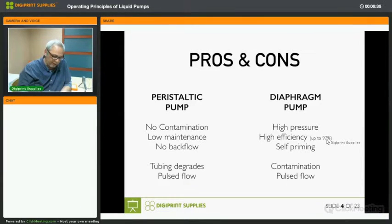You need to have a chamber that collects the ink and feeds the print head in a slow, smooth, continuous way. That's where your damper comes in, or the combination of a damper and a secondary ink tank, right?